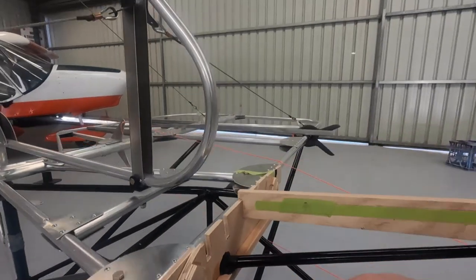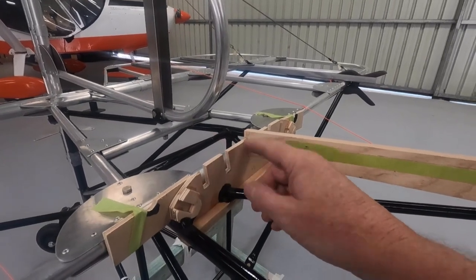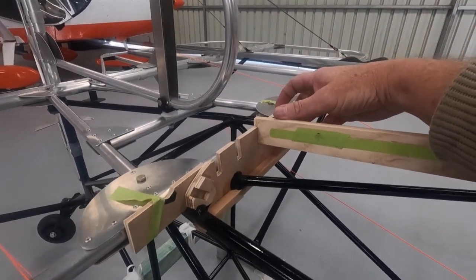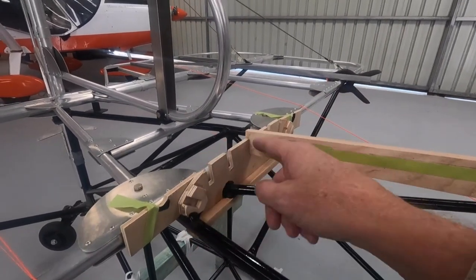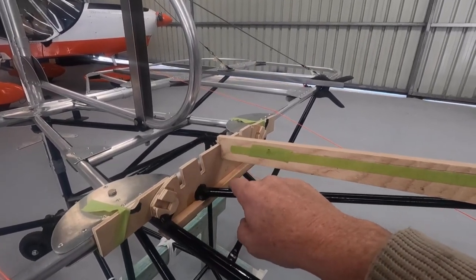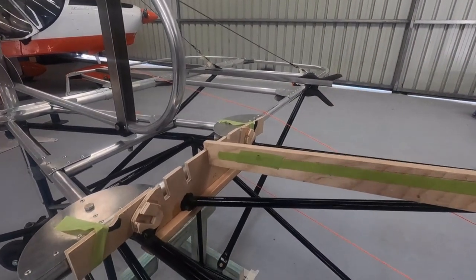When these are all bunched up — seven stringers on and this is only quarter inch — I'll probably fill this with balsa wood or something to give me a good half inch to an inch landing for the fabric to rest on. Balsa sands so nicely. I think I'll plane it down, prepare the edges, and then glue it in. We'll just go slow.